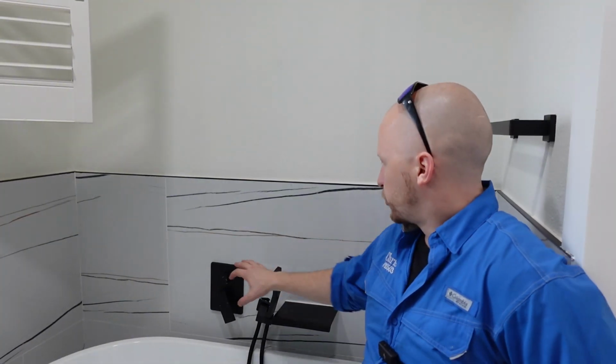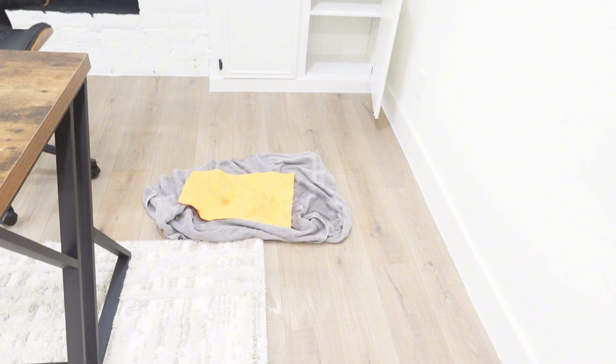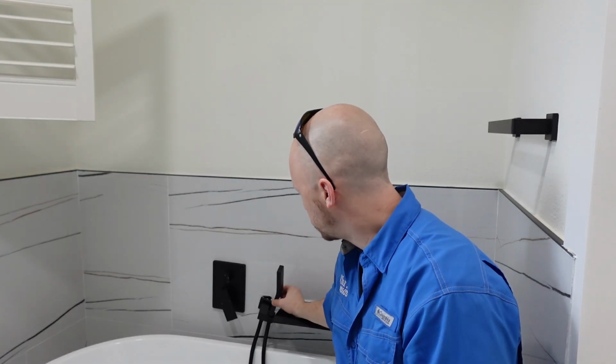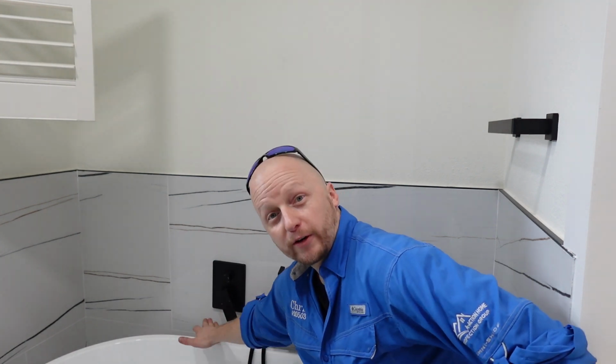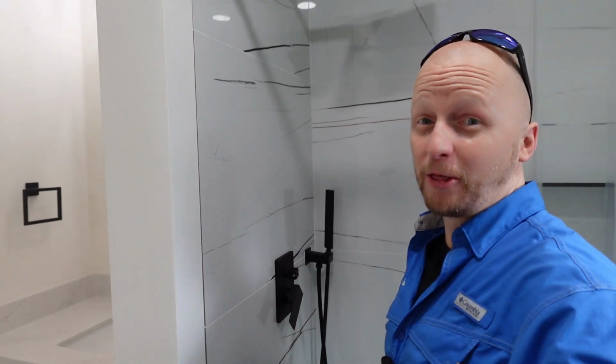Moving on into the interior of the structure, we already operated this. I can't do it again, unfortunately, because whenever we started operating the plumbing, it started leaking down into the first floor. So right here, you can see the whole fixture is loose at the wall, but it was actually leaking at the base over here, leaking at the base of the water fixture over here. And then in the shower, we had water leaking at the base of the shower fixture here and here. So the water's just leaking in all the plumbing in the bathroom.